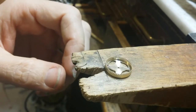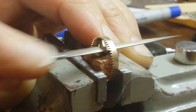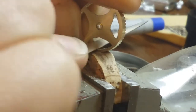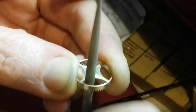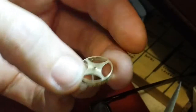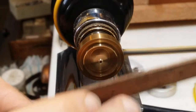It required a lot of filing — it was a very rough cut, so it requires a lot of filing, and that's fine because it allows for adjustment, final adjustment, and a better finish in the end. That first little bit I was holding the wheel between a plastic film and a piece of cork. The second little bit I was again using a piece of cork as support, and surprisingly, holding it freehand allowed me to do the final touch-up in the shape of each spoke a lot better than I would have anticipated.